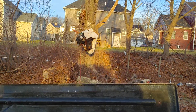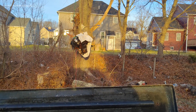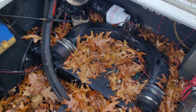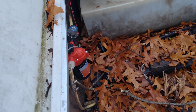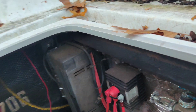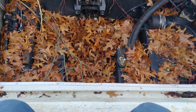The engine is a 5.7 Thunderbolt MerCruiser 350 with 260 horsepower — sadly hanging from a tree right now, but that's all we could do at the time. We've installed a new blower, a new bilge pump, and a new fresh water pump. We also have an automatic fire extinguisher system and a battery charger that needs to get rewired. We'll get the bilge cleaned up and repainted, then install the engine.